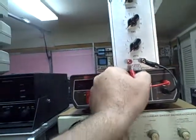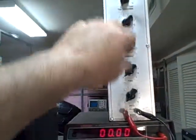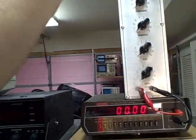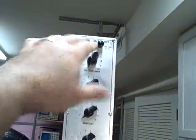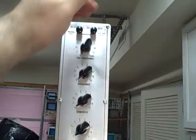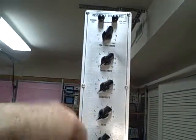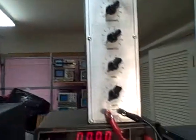There's also a comparator feature on this. It allows you to apply a resistance up top and then dial in a resistance below — when you hit half of your reading, you know what the unknown resistance is. You apply the resistor there, put a meter on it, and dial in from the bottom until you see half scale.